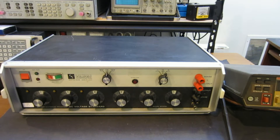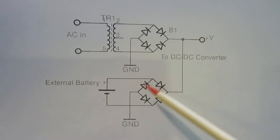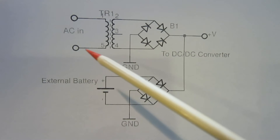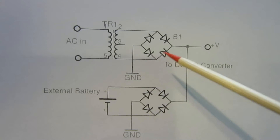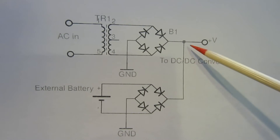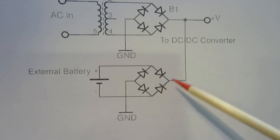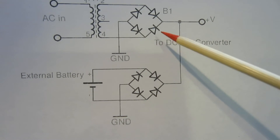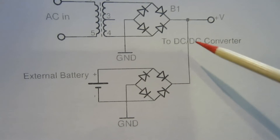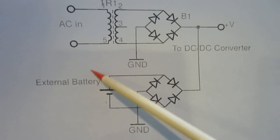The first thing I want to do is take a look at how the external power supply works. As I posted in my blog posting last time, if you look at the circuit diagram for the internal and external power, it's actually quite simple. When it's on external AC power, the power goes through the transformer and comes to this bridge rectifier and goes out. It converts to a DC voltage. And when on external battery power, the battery goes through another set of bridge rectifiers and also comes to the same positive rail. So this arrangement makes sure that none of these circuits are back-feeding into each other, essentially isolating the AC side of the power supply from your battery power supply.